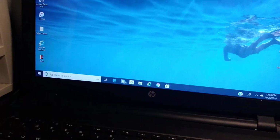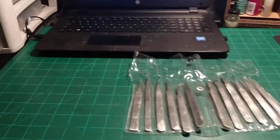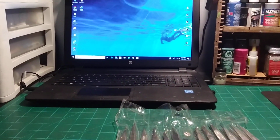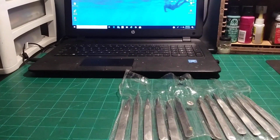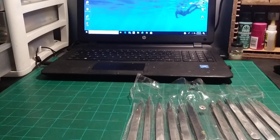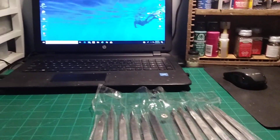That's that part. I was up working on the boat yesterday. If you guys saw the video that I posted the other day, that day we got the work done down in the bilge, pulling out wires and stuff that were not going anywhere. The previous owner of the boat had a sound system in there that we pulled out because it was all rotted. There were amplifiers and speaker wires running all over the place, not connected to things. So we got rid of that. Any other wiring that we found that wasn't doing anything, we removed. Pulled out the battery trays. One side was rotted, so we're cutting some marine grade plywood, and we're going to cover that with resin and some fiberglass and paint it and replace those pieces to hold the batteries.